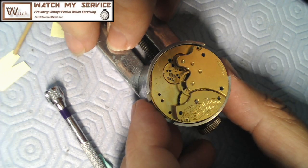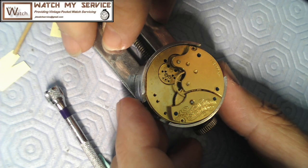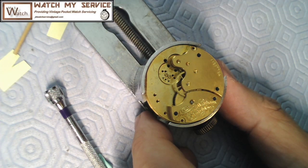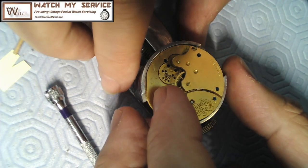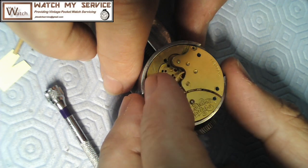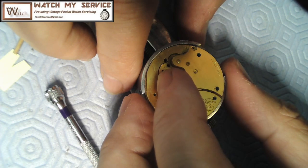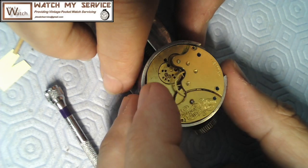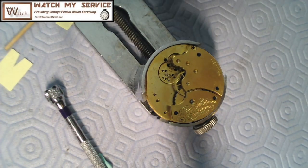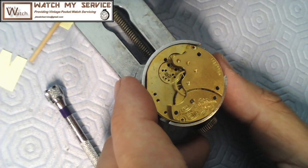You can see it's still spinning — you can just see a blur of the escapement going around in a circle. It's almost stopped. I'm going to push this a little beyond where it wants to go, which takes any residual pressure off that mainspring — just to make sure it doesn't want to turn any more. It's pushing back and forth and stopping in each direction, which means there's no more pressure on the mainspring. So I should be able to remove this plate and get the movement.